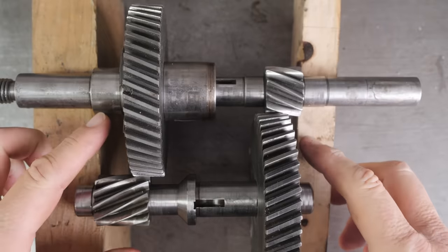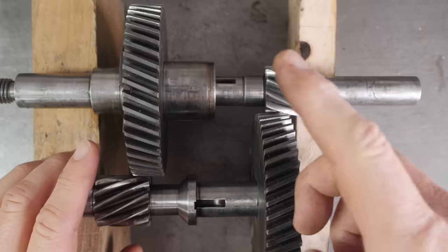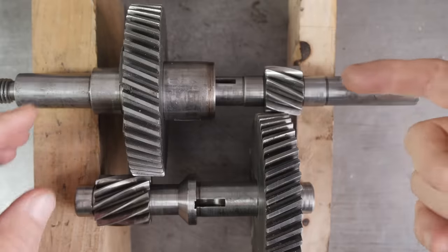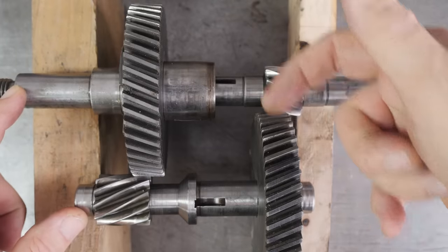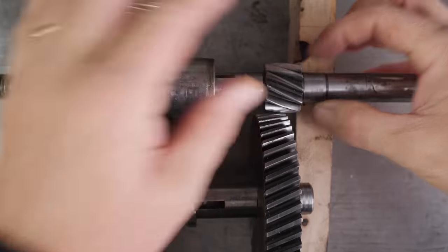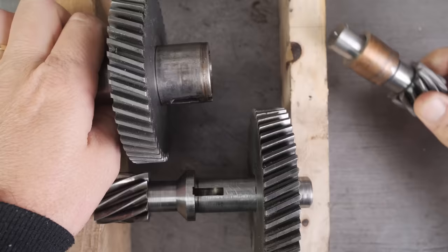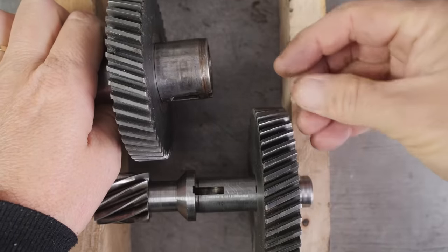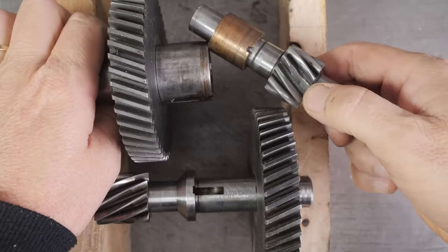Now, just a quick recap for any of you that might have missed the early parts of the series. John from New York, yep, I'm looking at you, you need to go back and watch them. The input shaft can either be one-to-one to the output shaft, or the back gear is input shaft down through the lay shaft back up and out. The input shaft is supported by two bearings, but the output shaft just gets one and an interstage bushing, and that's slogged out, released a Woodruff key which got munched between two gears, and a gear tooth lost.